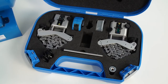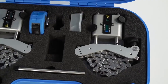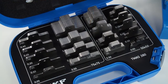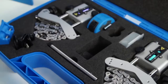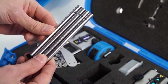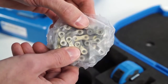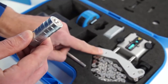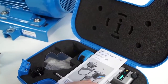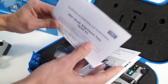The TKSA51 is a compact and comprehensive system. The complete system fits in a small SKF case weighing less than 3 kg, so it can easily be carried on an alignment job together with a case of machinery shims. The most useful accessories are already included in the case, such as extension rods to see over a coupling, extension chains for mounting the brackets on large shafts, and magnetic brackets to allow mounting on the side of the coupling. The TKSA51 is delivered with a quick start guide and a calibration certificate valid for 2 years. Contact SKF for more information about recalibration.